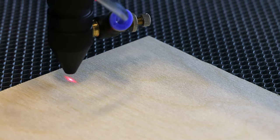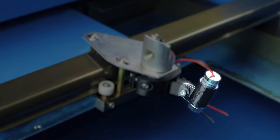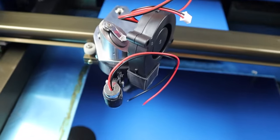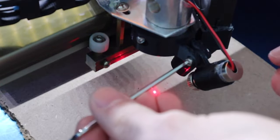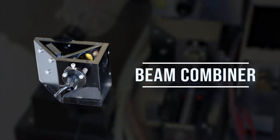Most gantry-style lasers use a laser pointer for part placement, and you need this for aligning your engraving up to the materials to be lasered. Some companies will actually stick a really small red dot laser pointer on the side of the laser head with two really small adjustment or lockdown screws. These are not that great — they can easily be knocked loose or jarred from the movement, and even the laser head moving back and forth can cause them to be misaligned.